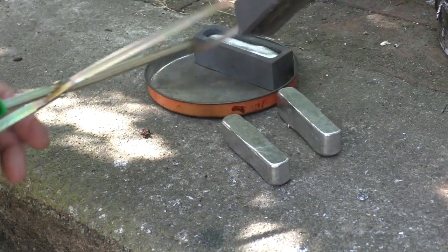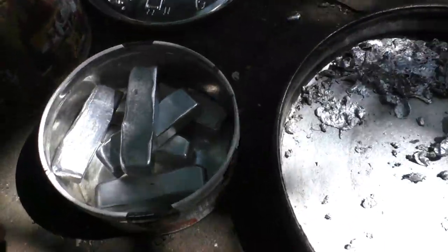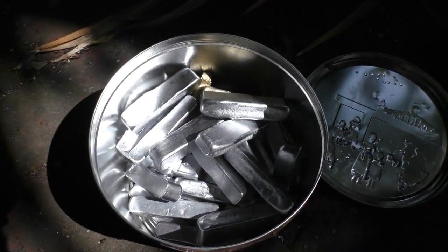That's the stash from that day's work, and that's what I've done so far — a mixture of hard drives and also one old bicycle rim I chopped up just to experiment. Now I've got all these ingots of much cleaner aluminium. The plan with these is to experiment with lost PLA casting, which I've been watching on YouTube — people printing positive molds in PLA, making a plaster cast, then melting the PLA out to leave a mold you can pour aluminium into.